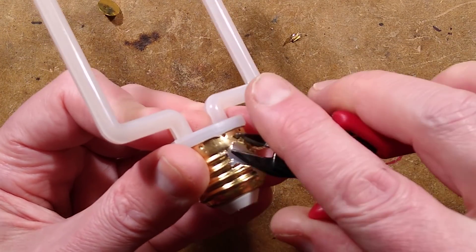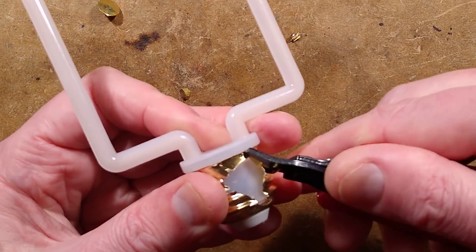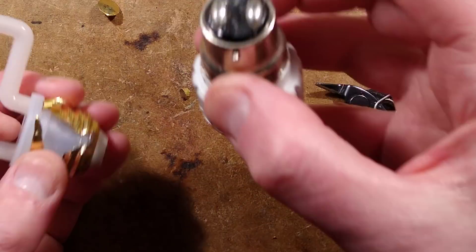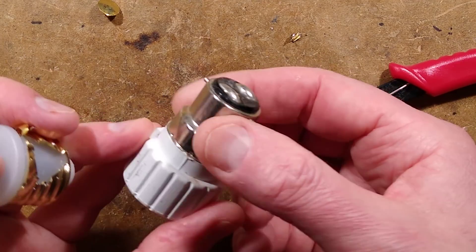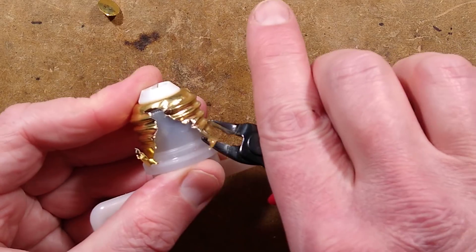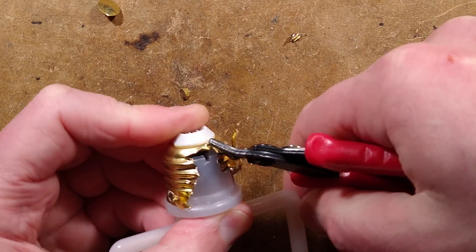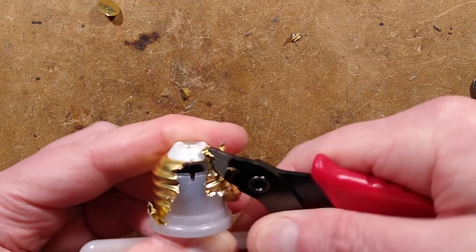That provides extra insulation from the side for the circuitry, and also means that if they do a bayonet cap version for the British market and other countries that use the same bayonet cap system, it provides insulation from the side. In our lamp caps, the two end contacts are live and neutral either way around, but this bit here can be grounded in some fittings — it's not actually used as an electrical connection. It's safer; it means people fumbling to get lamps in don't put their fingers in the contacts. So is this going to be a capacitive dropper, a linear current regulator, or a little switching regulator? So many options.